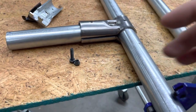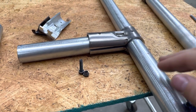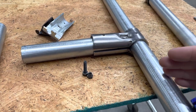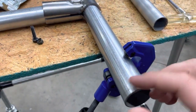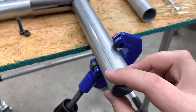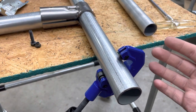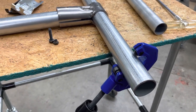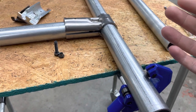It's still just as easy to use even though it's a larger pipe and larger connector — you just need a five millimeter hex wrench to assemble it, and when you're tightening the bolt, the nut will lock in place. If you don't know about top rail, if you have a chain link fence near you, just pay attention at the very top going horizontally — you'll see this pipe, which is known as top rail. It's an inch and three-eighths diameter, galvanized, made to be used outdoors and withstand harsh weather. It's just like conduit in that it's a great pipe — strong, with a great value-to-strength benefit. With the connector solution and building system, you'll be able to use it for your DIY projects.